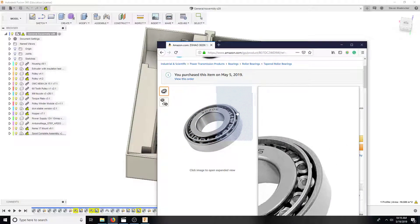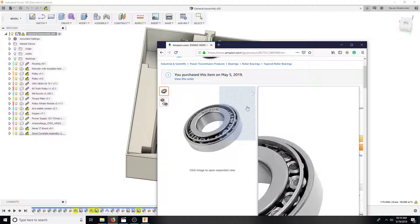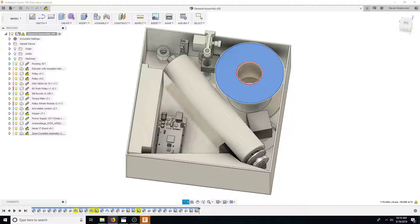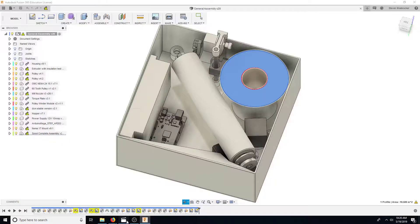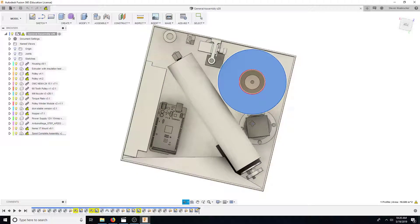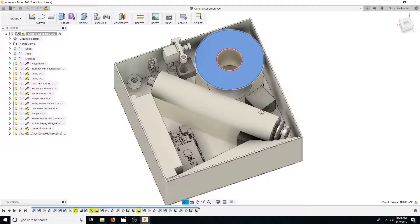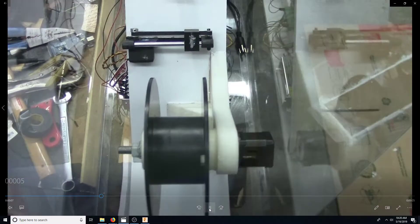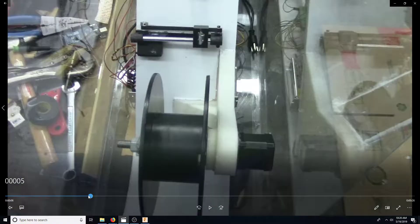On a regular bearing, the pieces are not supposed to bear on each other because one is turning and one is staying still — you don't want them to touch and increase friction. That's really helpful because we can shove it onto the nut with a lot of force. The really nice thing is that we're not reliant on friction — we're reliant on this gear. All this nut is doing is holding it onto the taper roller bearing and onto the gear so it doesn't slip off.